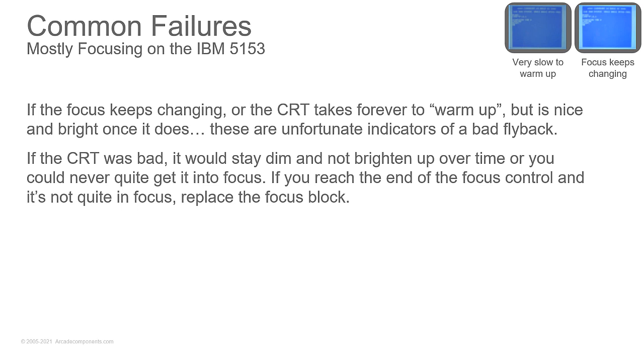I have two monitors over here in my game room. One's a Merit Megatouch upright bar game, and the other one is the same thing, except I stripped it out, put a new computer in it, and made a touchscreen jukebox. Both of them would take about 45 minutes to get up to full brightness. I checked them with the tube rejuvenator, and everything looked great. So I replaced the flyback, boom, nice and bright.